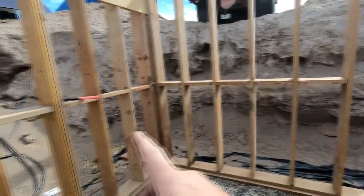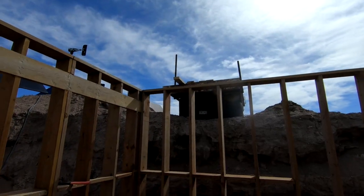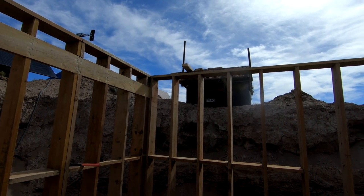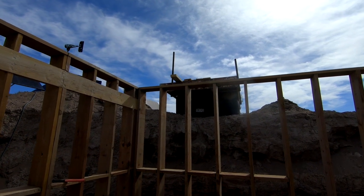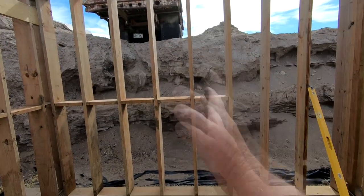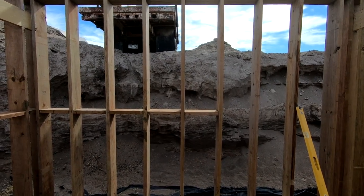Really important in this corner, because right above this area of the basement on the first floor is going to be a really heavy solar battery. When I say heavy, I'm thinking this floor's got to hold up to 2 tons of battery. So no problem, really, because if just one stud is blocked and sheathed properly, it can hold probably 8,000-9,000 pounds just by itself.